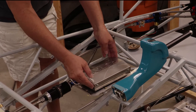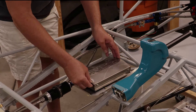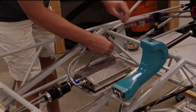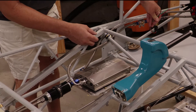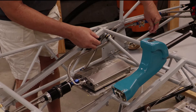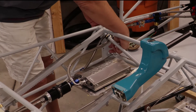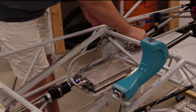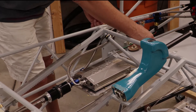I'll then need to run just a couple wires into the fuel pump assembly, from above and well insulated, to minimize any chafing that could cause a spark. Then I'll need to run only a few wires through an inline connector to the fuel pressure sensor mounted under the left kick panel. One goal is to keep fuel lines away from wires, so I'm running all the fuel hoses down the left side of the fuselage while running all the wires down the right side. Planning this early in the build allows for this design consideration.